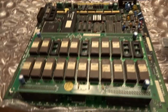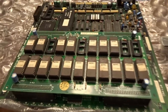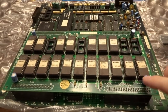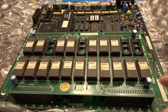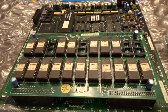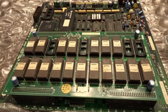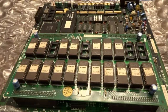To give a bit more detail on the board's makeup: you have a motherboard and a daughter board, and this top board has all your game ROMs on it. Two of these ROMs need to be replaced due to the board design — they communicate with the suicide battery in the main processor. The kit includes two replacement ROMs with the game data on them, plus a new processor unit that doesn't have a battery, to take care of the battery problem.